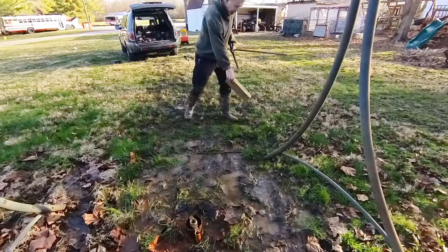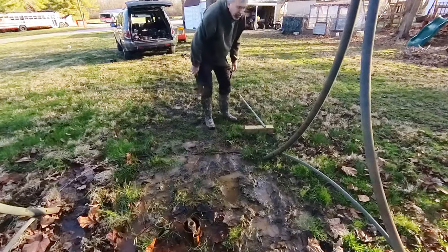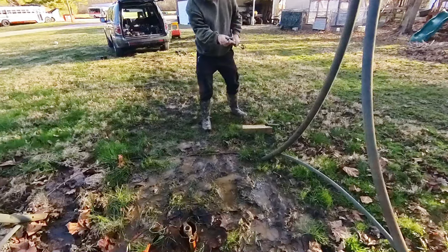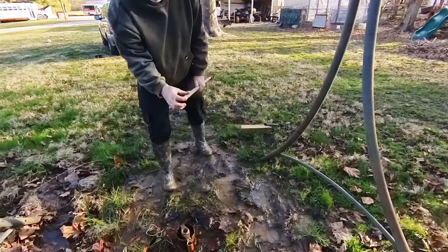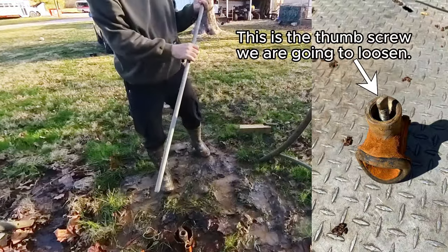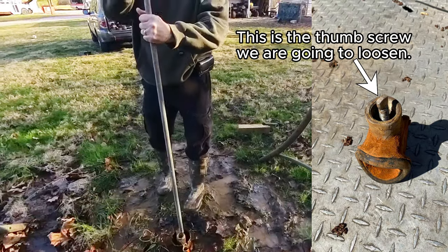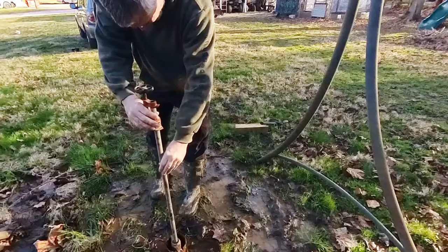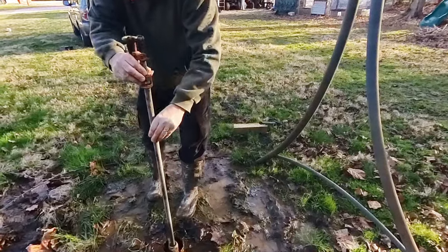There is a pitless adapter down there. I don't have my tool right now to do that, so what I typically do is I'll feed this guy a little slit, which I'll show you here in a minute. And then we'll be able to actually go down and feel that thing. I'm gonna see right now though if I can feel it. Oh, I do. Okay, that's great.